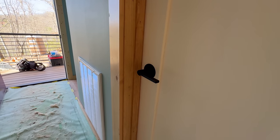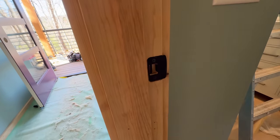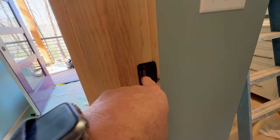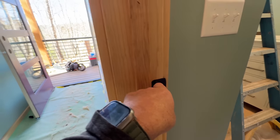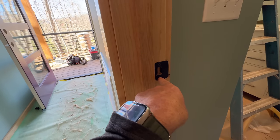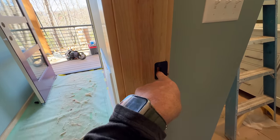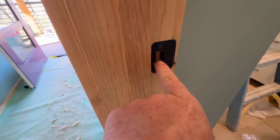It might be too high. It didn't shut because it's too high — it looks flush with our wood but it's like a fingernail above it. I don't want to have to try to move this because the screws go back into the same screw hole, so we need to pull this plate off and file this little bottom part about an eighth of an inch off.